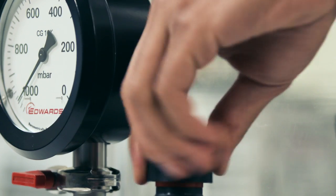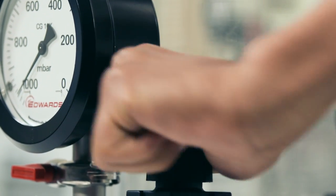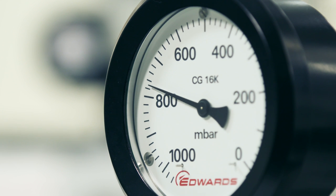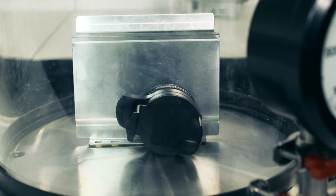So I'll close this valve to prevent any atmospheric air from entering the chamber and then I'll open this valve to allow the pump to remove the air. So as the pressure within the bell jar drops and the force externally acting on the suction cup drops, it will eventually equalise and the cup will fall off.